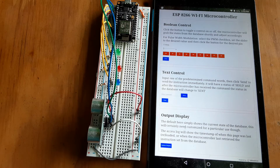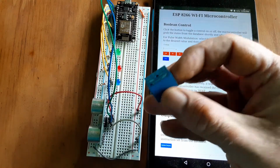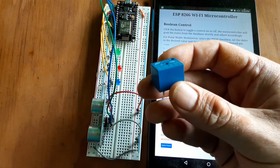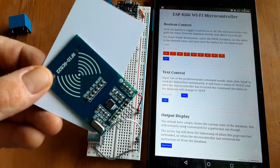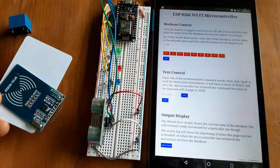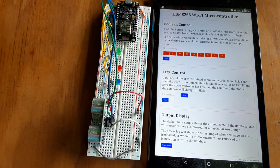and activating and deactivating LEDs isn't going to be that different from activating and deactivating relays, which can handle any voltage you have in your house. So you can turn on and off anything in your house. A distance sensor might not be what you want, but it's not that different to hook up a fancier sensor, stick in an RFID sensor to log when your kids do their chores or something. It's not that different to plug up different sensors, because really the microcontroller is just turning on and off things. So this seemed like a nice clean example to start with.